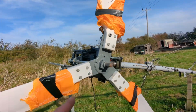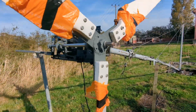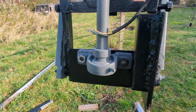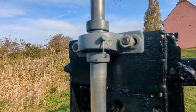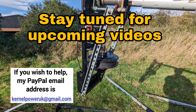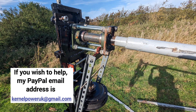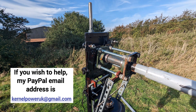What I have to do now is get my son to take the blades off and then the tail out, and then change the orientation of the turbine because I need to double-check the drive shaft has an equal distance on the left and the right — just get that sorted. The good news is they won't have to be interfered with again. I'm going to call it a day on the video for now, and the next part I'll just be making sure this is slap bang in the middle at the top and the bottom — we can measure it in two places here and here.